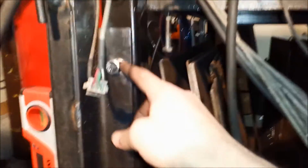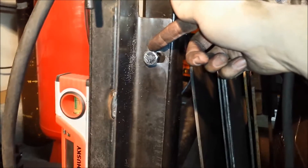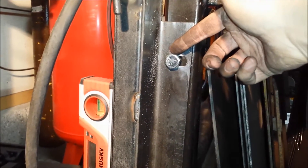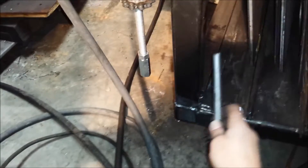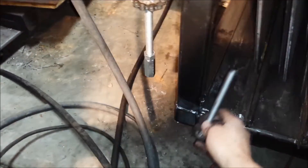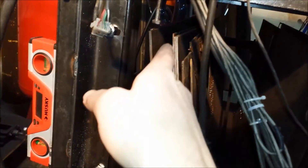I had to do the same thing on this side; however, the bushing support I had right here was fixed. I made this elevator adjustable — sorry about all the cables in the way. You can see I elongated the hole here; if I have to, I'll elongate it even further. This is why this elevator isn't tightened down: I was going to put this other chain on and tighten everything up, but the support bracket also needs to be adjustable, because if I adjust that in and out it causes too much binding. Both of these elevators are the ones with two sprockets each, and that allows me to adjust the chains.